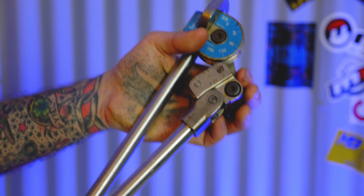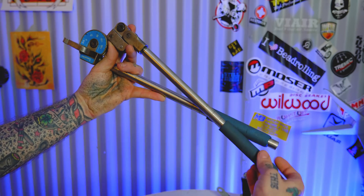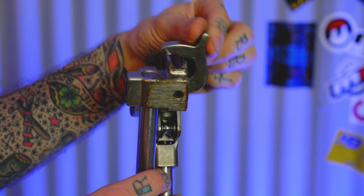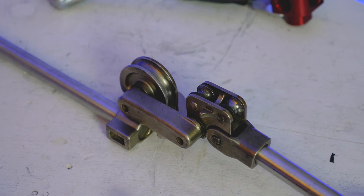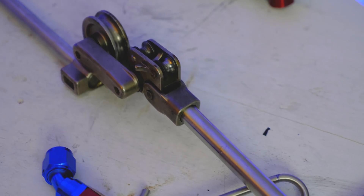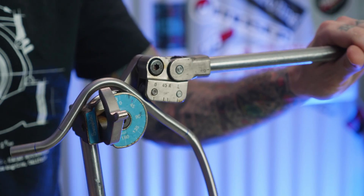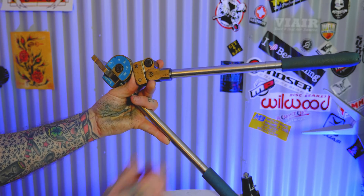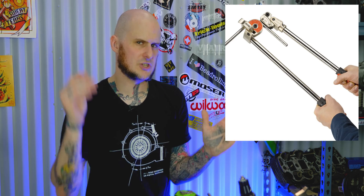The type of bender I'm switching to that I really like is the Swagelok-style tubing bender. They have strong, replaceable pivot points, you can disassemble them to lube, clean, or repair them, and they're larger to provide more leverage for harder materials. They have a swing-out leg that locks the tubing in place, making it easier to feed tubing in when you have multiple bends close together. The biggest feature is rollers on the follower, which leave fewer tooling marks and decrease friction. These are pricier — the 3/8-inch Swagelok runs about $250–$300 new — but Rigid and other companies make clones ranging from about $100–$200.